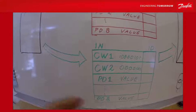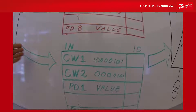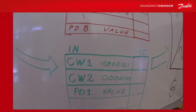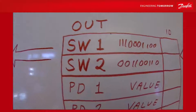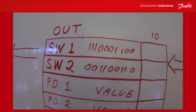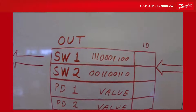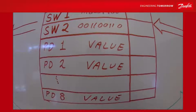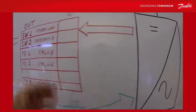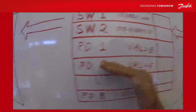The information sent between the drive and the PLC is a set of words. The drive calls the words going toward the PLC the 'out words.' For information sent from the drive to the PLC, there are two status words — bitwise, where each bit means something: ready, run, fault, in sync, contactor statuses, input and output statuses. There is also process data — process values from the drive such as DC voltage, temperatures, currents, active current, reactive current. You find the ID number for the desired data in the manual and enter it, and that value will be transferred to the PLC.